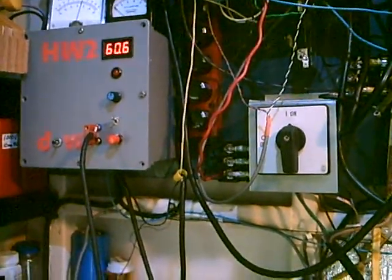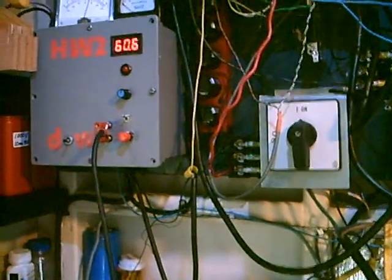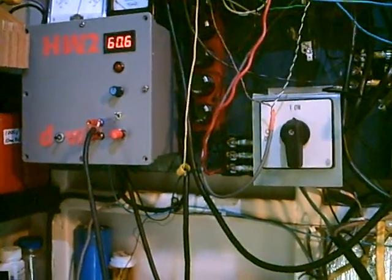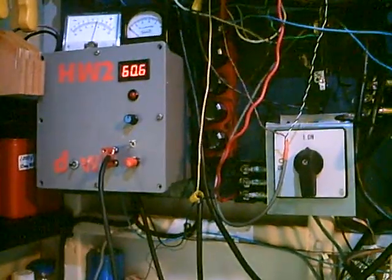What this allows you to do is operate this water heater controller in parallel with an existing charge controller, as long as you isolate the two with a diode so the capacitor bank isn't feeding into the controller — that could potentially blow things up.